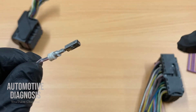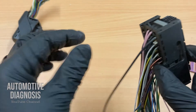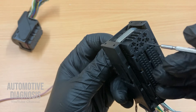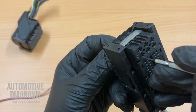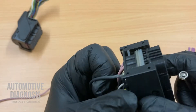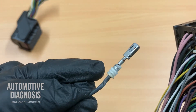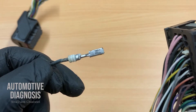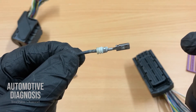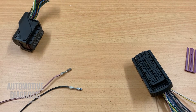Then you can take the pin out from the back. Let me practice on another wire — this black one — I do the same thing. This time I try to do it one by one: one from this side first, then the other side. First I push this one, and at the same time you need to pull the wire from the back slightly — don't pull it hard. Then release the other side, and then you can take the wire out.